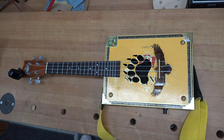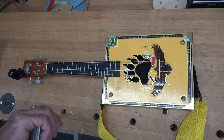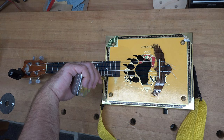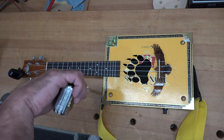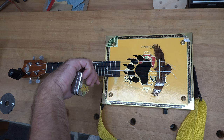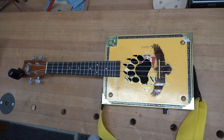The next thing you want to do is calculate the width of the sides of your instrument case. Just measure the thickest point - don't forget to include the strings and the bridge. It looks like two and a half would be an absolute tight fit. I don't want a tight fit; in fact I want some room there, and I also want a little thicker case. So I'm going to make this one three and a half inches wide.